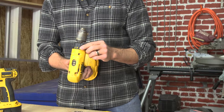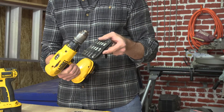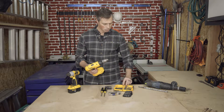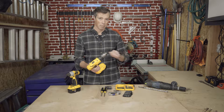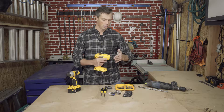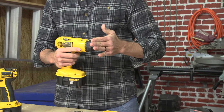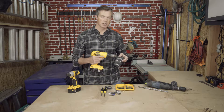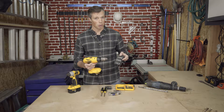This particular drill has a hammer drill option built inside. What it does is accept a masonry bit — a specialty bit that drives into concrete and brick. Normal drill bits usually won't go into masonry without dulling themselves out right away. The hammer drill sends a tapping motion to the bit, popping it in and out of the concrete rather than just a straight drive. It hammers the masonry bit into the wall, making it very effective for putting holes in surfaces you normally couldn't drill through with a standard bit.